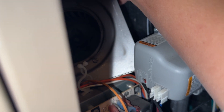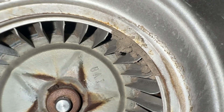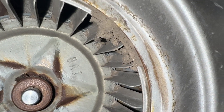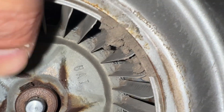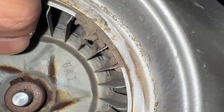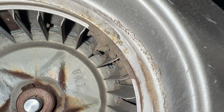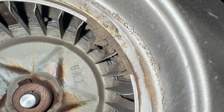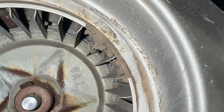I'm trying to get the inducer motor out and I found something interesting. It looks like an animal or bugs have been getting in here and created a nest, and it's kind of seized up the blade to the frame. I'm hoping that if I just remove all the stuff right here then the blades will be free again.